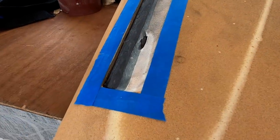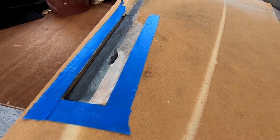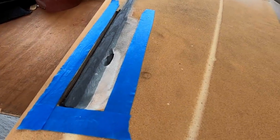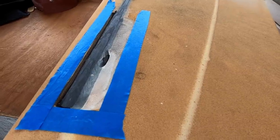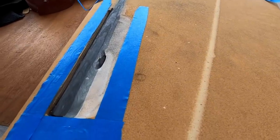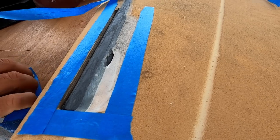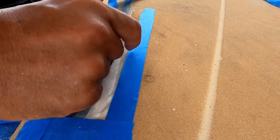So what does this steering thing do that you said? It helps transfer the torque from the rudder stock into the blade skins. So transferring torque, not load. Yeah, torque. So that's the turning motion. Is it just going to be a bit of laminating carbon? Yeah, so it's just a little bit of carbon that goes from the stock and then creates a tab